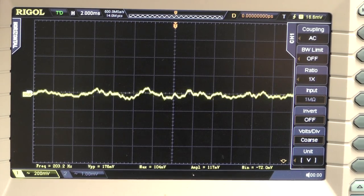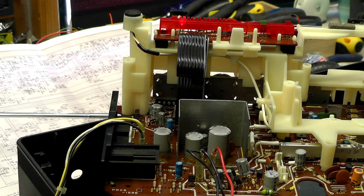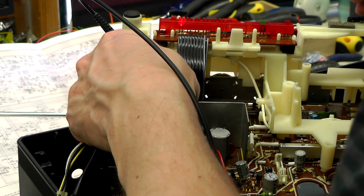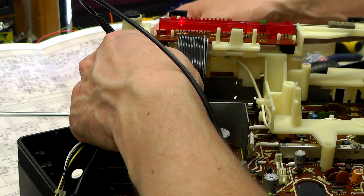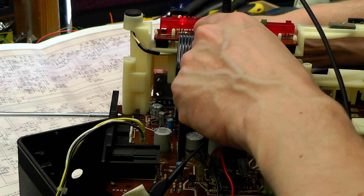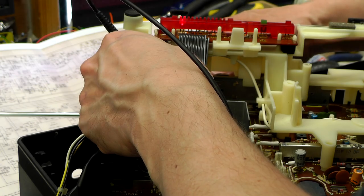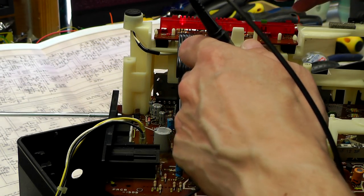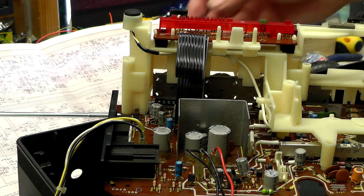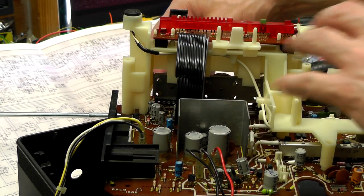Let's look a little further downstream. I'm not too sure the problem is really coming from the volume controls, so I'll take the scope to the resistors feeding the main amplifier IC and tap them. You can hear that clicking — it's interfering with the feed to the amplifier. Doing the same on the other side — that's tapping away too. This is kind of showing me that the main amplifier IC is probably okay. The dead channel does seem to come and go as I turn the volume control, so I think the problem really is the volume control.